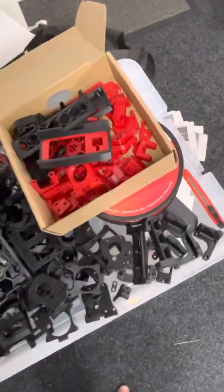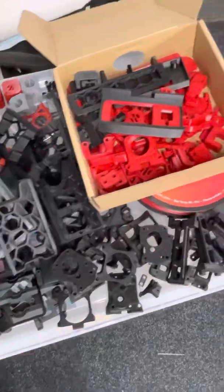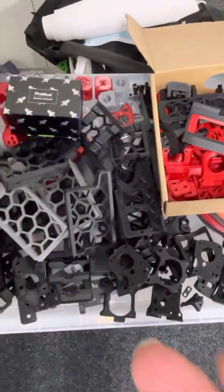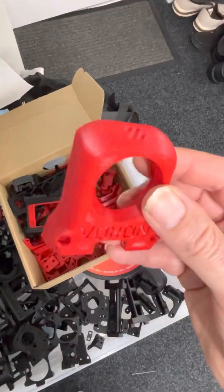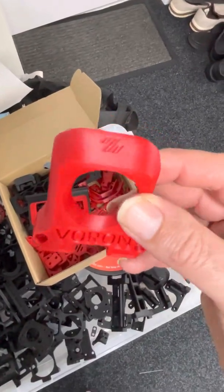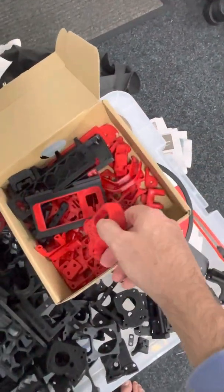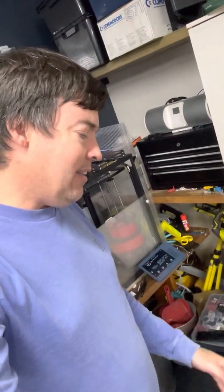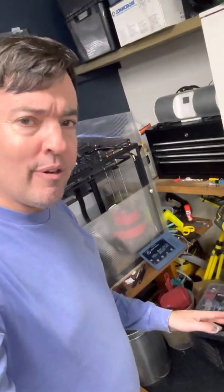What am I printing right now? Well I'm printing some parts for a Voron. It's a large and complicated 3D printer with a quad gantry leveling system — I'm not sure it's necessary to be perfectly honest; I think it's possibly a little over complicated. Some of the pieces are very recognizable — this is the front of the hot end assembly and you can see the nice surface of the glass print bed. You can also see it's shrunk a little around the edges, which can be a problem. This is printed in ABS, obviously quite a high temperature. I think by the time you've modified your 3D printer to print the parts for a Voron, you don't actually need a Voron anymore.